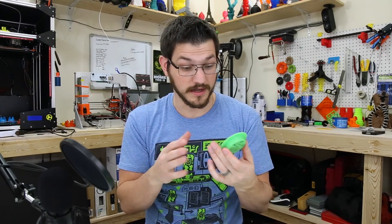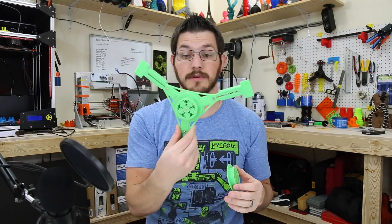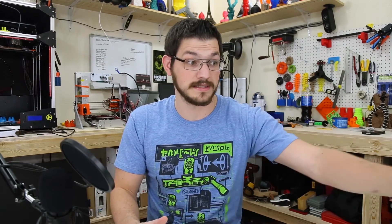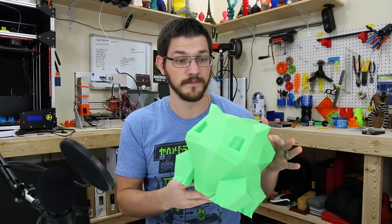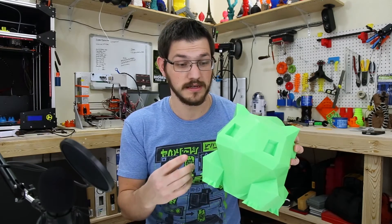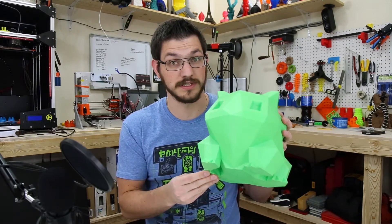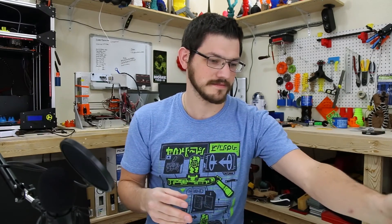Anyway, other than the bearing issue — which was my settings, not the filament — everything printed beautifully. I can't knock it at all. The only other thing I noticed was some elephant footing on the bottom where layers bonded together from being a bit too close, and the gears in the middle had adhered to each other. There are only six gears so it's not a lot to mess up, but when you do it doesn't work. To wrap this up, this is a great, cheap filament you can pick up on Amazon. I printed it at 215°C with the inner perimeter at 100mm/s, middle at 90mm/s, and outer at 70mm/s — pretty fast — and it's a good filament.